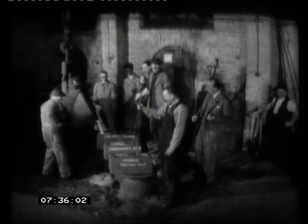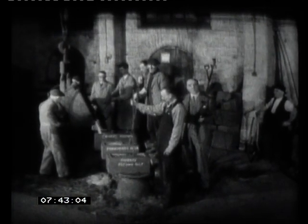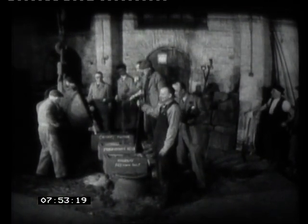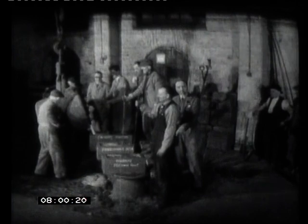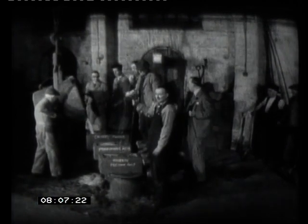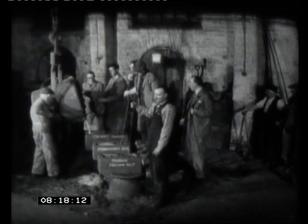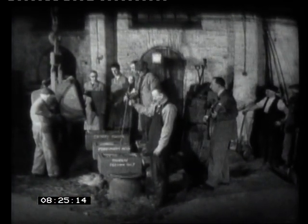Another rather intriguing thing to me that never occurred to me was this, that in the days I've just told you about, when they used to take the furnace to the church and cast the bells, they hadn't got a crane to lift a ladle like this. This is about the only concession to modernity I've seen here, I think. And so what they used to do, they used to bury these cores right in the ground and then run a channel, a trough, from the furnace right across the floor and into these, so that they didn't need to lift the metal at all. They used to pour it in. And then eventually, when the metal cools, they lift that off, they dig the core and the cope out, they break them apart, and beneath they find the bells. And I don't know whether you can see, but on each of these is chalked the destination where the bells are going to.